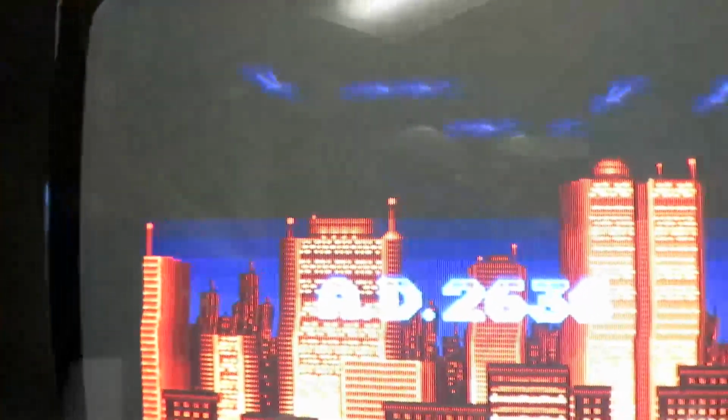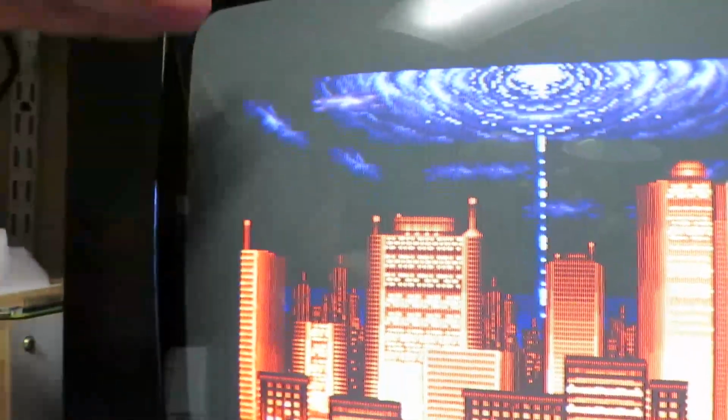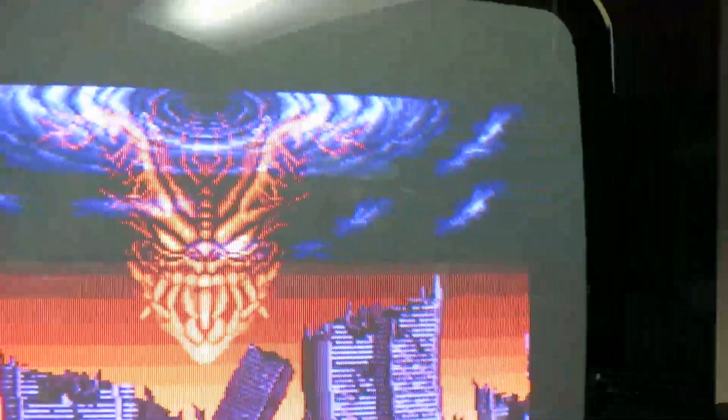Now, a line is always going to be a line. This line is drawn at the same frequency. We're basically just defaulting to the standard behavior of a standard resolution monitor. This is like the NTSC signal. So the lines we cannot stretch. However, we can stretch the pixels, how often the pixels are drawn, right? And we do this by changing the pixel clock.